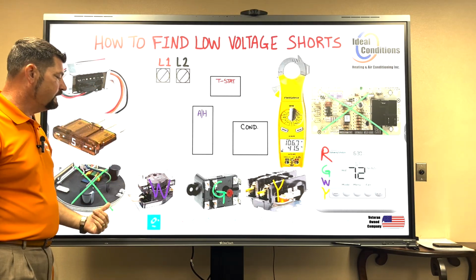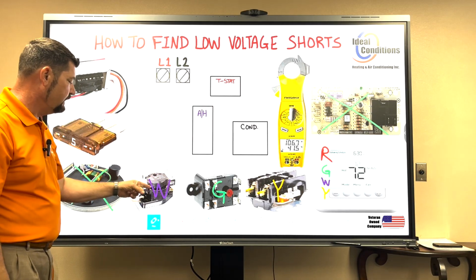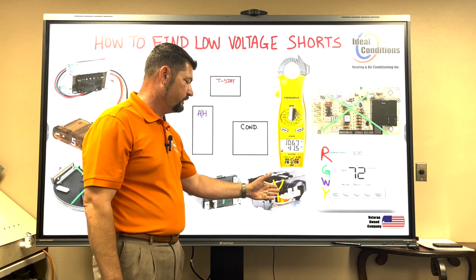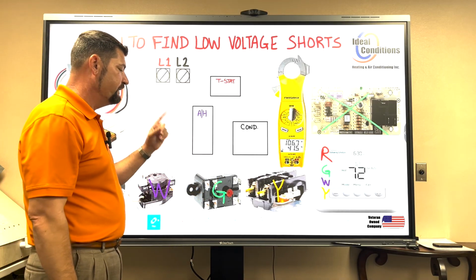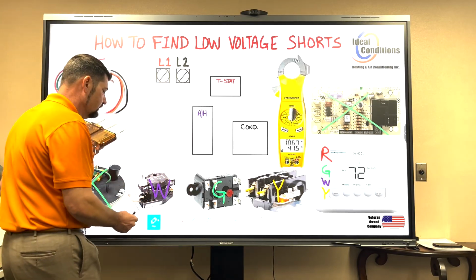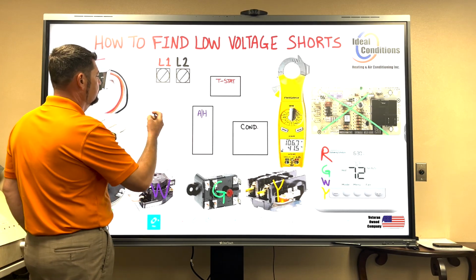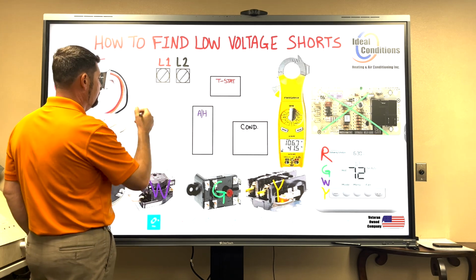Or was I running in heat mode, where I was definitely running a blower control and a heater relay? So if I'm always going to run the fan with the compressor, the fan with the electric heater, or the fan by itself, then the very first step, I told you I was going to do this in a step process, and we'll write these down, should be step one.